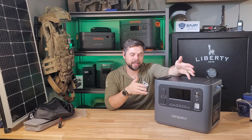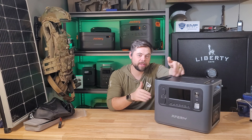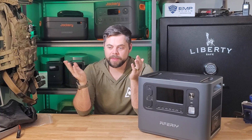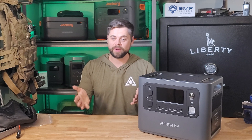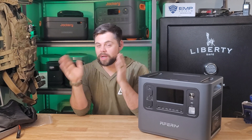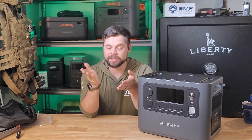It's pretty common for inverters to be around 85 to 90 percent efficient, meaning you're going to get about 90 percent of the capacity out of the battery — so we'll just call that 1800 watt-hours for easy math. Now back to the fridge: because it's not running for 60 minutes of an hour, it's not going to use 400 watt-hours. A typical fridge will run maybe for a total of 20 minutes per hour, cycling on for five minutes, cooling down, then sitting for 10 or 15 minutes before turning back on. That's why I say it's 150 watt-hours per hour on average — if you run a 100-watt load for 30 minutes of one hour, that's 50 percent, so it's going to use 50 watt-hours in that hour.